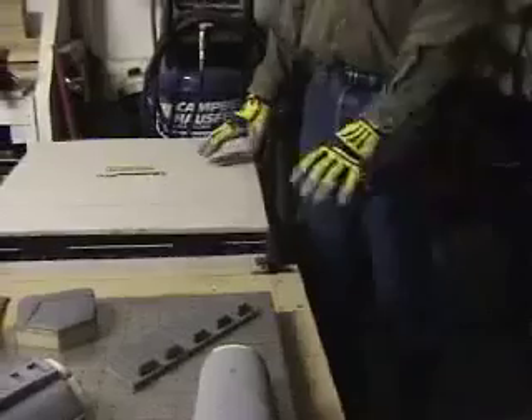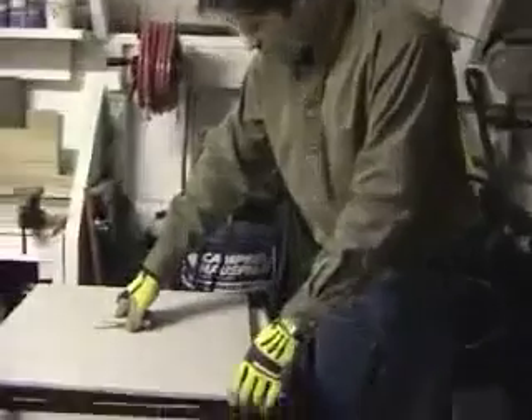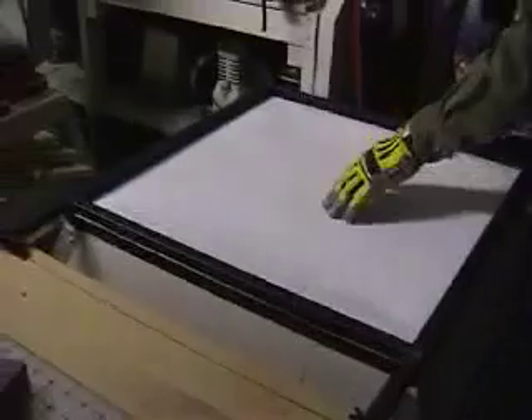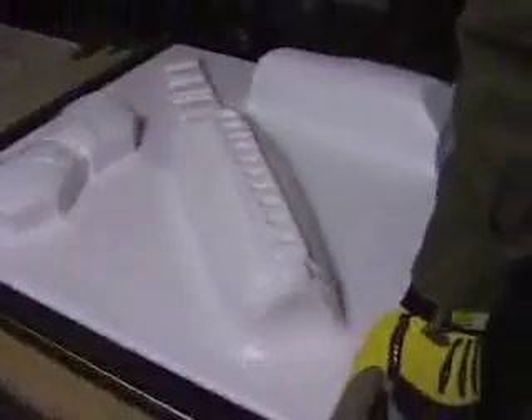As you can see, as I run my finger over it, it's already pretty soft. If one corner of the plastic's not hot enough and another has gotten hot enough, we want to regulate that heat a little bit — you can slide the lid back and forth and let some of the hot air out. We're starting to get that vinyl feel in about 4 minutes and we're going to be real close here real fast. We've got a better seal on the tank right now.